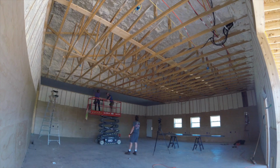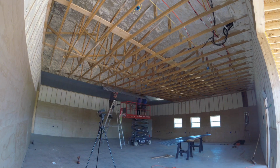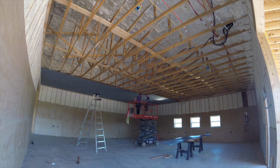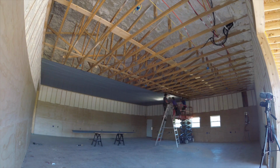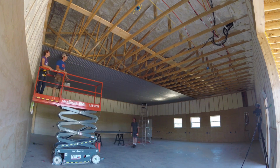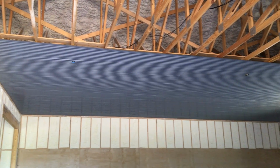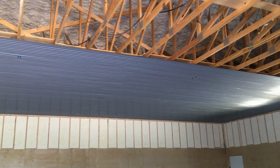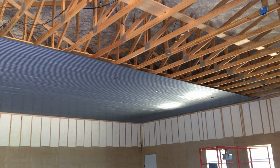On that note, it's also a good idea, once you have up a row, to look down it before you move the lift down so that you can see if you need to compensate at all. When getting to the headlap, I would make sure to tuck the end of the current panel under the previous row just to keep things uniform. Other things that helped with uniformity in the end is paying attention that the seams are lining up nice and straight, and that the corrugations are seating nice and snugly to the previous panel.